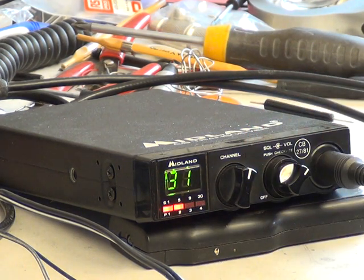No, roger that. With hindsight, when this came into repair, we should have done a video on this one, because it's a totally different chassis to the 77805 which we previously did. This is the 77805D, as in D for Delta, and in the receive it uses a chip, whereas the ordinary 805 uses quite a lot of different transistors.